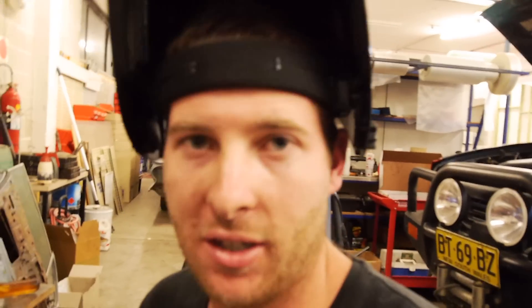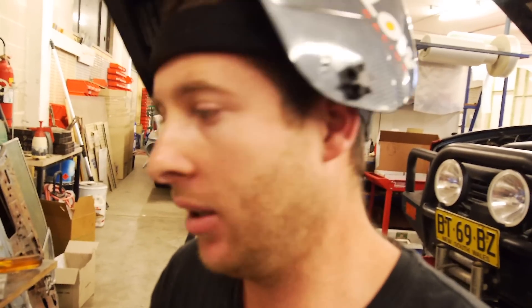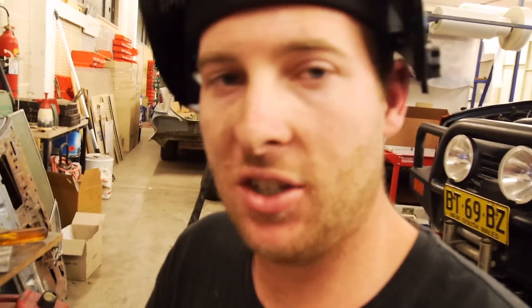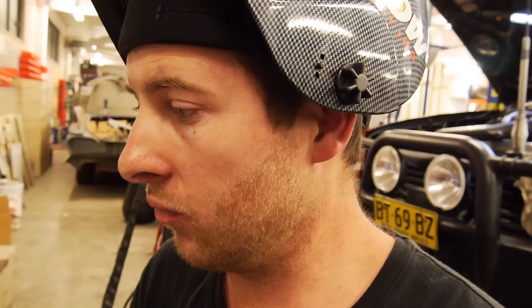I'll let that cool down slowly by itself because cast iron needs to really cool slowly, otherwise it'll crack. As I said when welding the manifold, little stuff like this you can get away with not preheating because it heats up really quick since it's so small. But for big stuff, you've got to preheat it and cool it really slowly. That should hold up — it's nothing major. I'll chuck it on the linisher, make sure it's flat, then whack it back on the inlet manifold and we're just about done.